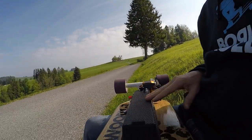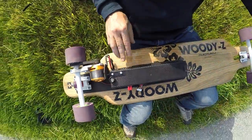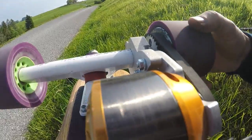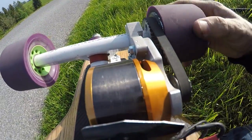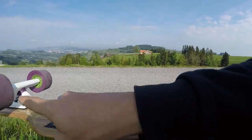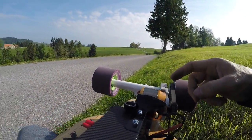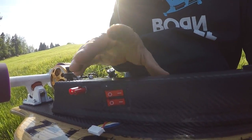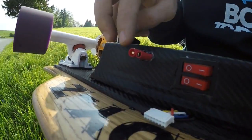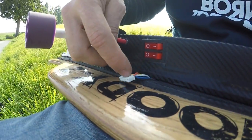I ended up using a carbon vinyl coating on a Tupperware container, which luckily fit my purposes. I also noticed the motor was taking damage from stones flying up, so I mounted a little protection here — stones typically come from the front of the board and hit the guard before they hit the motor. The housing has a switch so you can easily switch it on and off, a charging outlet, and a balancer port so I don't have to always unscrew the housing.